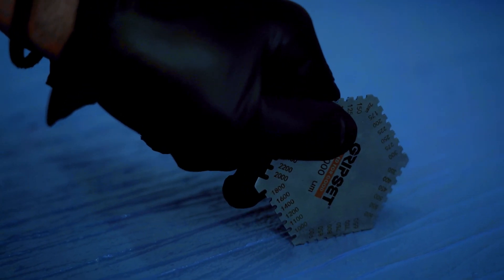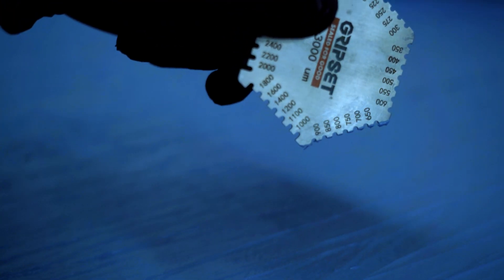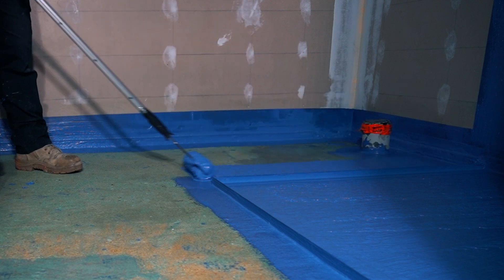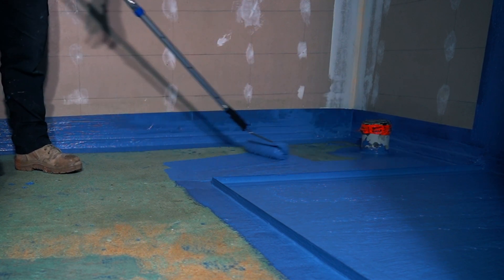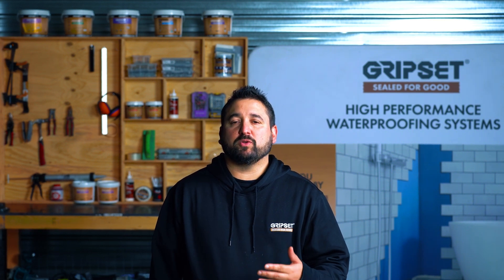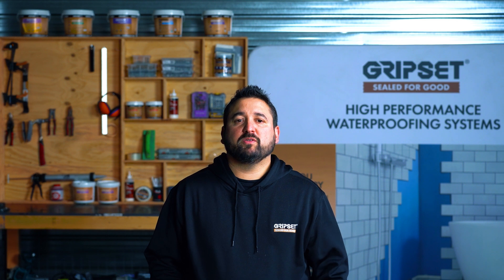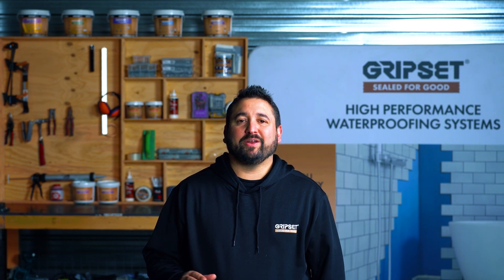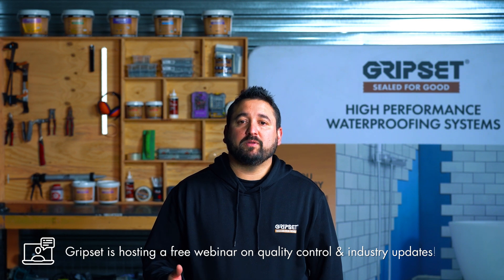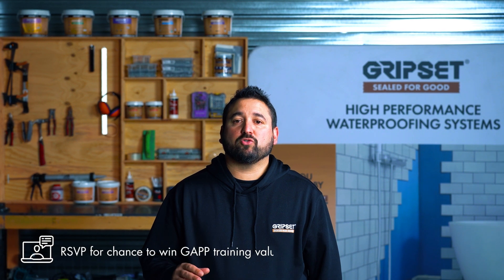The standard also makes recommendations for conducting regular checks during installation with regards to wet film testing. Based on the findings of the inspection, the builder can proceed with coordinating overlay finishes, or the waterproofing contractor must be re-engaged to make necessary repairs to meet compliance. Together with the pre-inspection safeguards discussed last week, the provisions for post-inspections reiterate the standard's efforts at improving the quality and overall efficiency of the waterproofing application as a construction process.